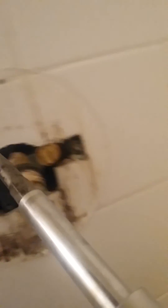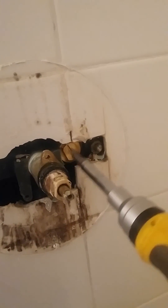Before you ever get to that — this is your cold shutoff and this is your hot. Make sure you've got those screws tightened all the way in before you try to take that out, or this cover off of the stem, which is this big piece here. Make sure you do that, because if not, the pressure will push the stem out, and when you take this out you're going to have a major leak running behind your tile.